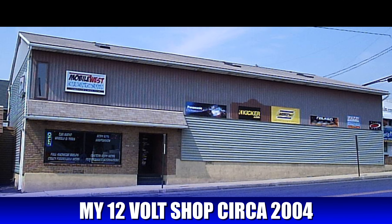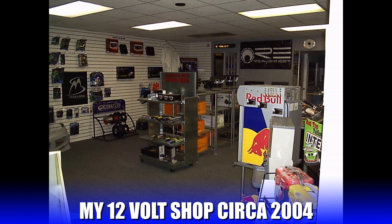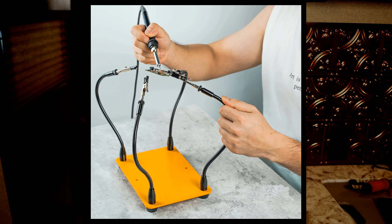There are a couple of different accepted methods of connecting wires in a 12-volt application. As a former car audio and electronics technician and store owner, I will tell you the best way to connect wires is to solder them and insulate them using heat shrink. That is hands down the best way, however that process can be difficult where you don't have the opportunity to use a helping-hands device and solder on a bench. So in the interest of real-world RV application, there are two other methods you can use.